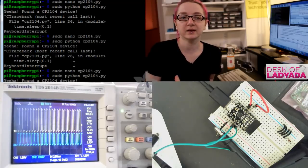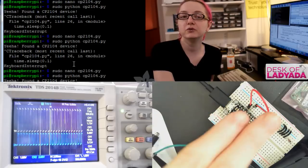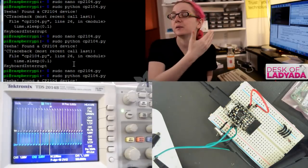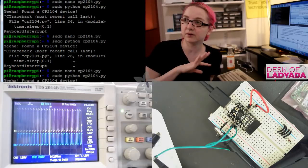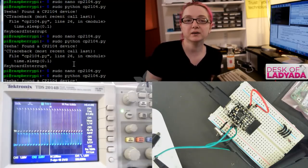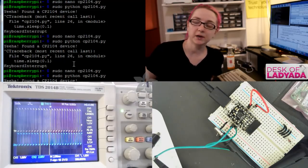So what's really nice is I can connect these two GPIOs to Raspberry Pi GPIO pins, and then I'll toggle them and read the pin on the other side. That way I'll know that those pins came through and were connected. So that's a good way to do a full functional test of every exposed pin. And when I do the write-up for this product, I'll also have this little bit of code, for people who want to twiddle these GPIO pins, to show how you do it.